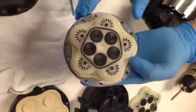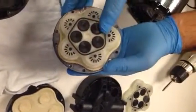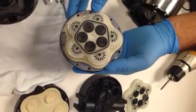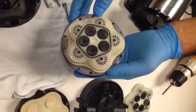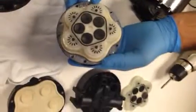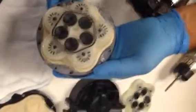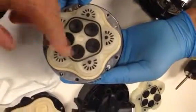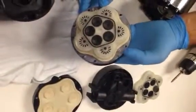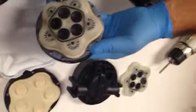Our pumps are made to handle most commercially available cleaning chemicals or cleaning solutions. If some other unique solvent or more aggressive hydrocarbon-based product is used, our Viton valves will be able to withstand most of those as well, but there are some chemicals that may be tried that would show some swelling of the valves or shrinking of the valves, in which case these would have to be replaced. Our pump is not really intended for those, but the replacement of the valve housing assembly would resolve that.